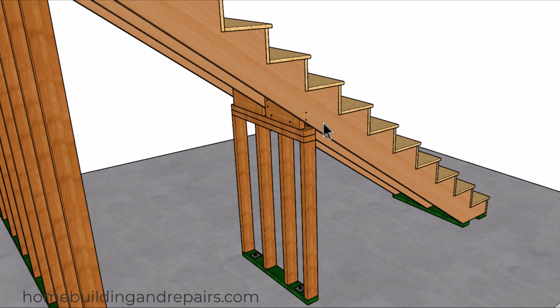So most long stairways are going to have a support wall underneath them. However, this might not be necessary if you use larger stringers and thicker treads and risers. For example, you might have a 4x12 stringer and 2x construction standard materials for your treads and risers. So if you don't like the wall under the stairs, or you can't use a wall under the stairs, and you don't want the stairs to swing to the right or the left or even bow down as weight is applied to them by having multiple people walk up and down them.